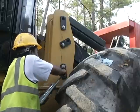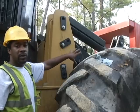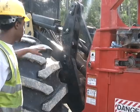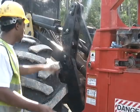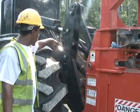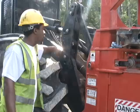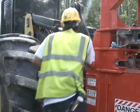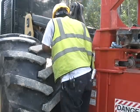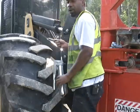So we got those three for this part of the arm, and then next I'm going to move to the forward part of the arm, which has four. On the forward part of your head, you have four grease fittings — one, two, three, and then there's one more located right on the other side, right behind this tire right here. I'm going to go ahead and get these real quick. And that is it — I got the four right here on your arm.